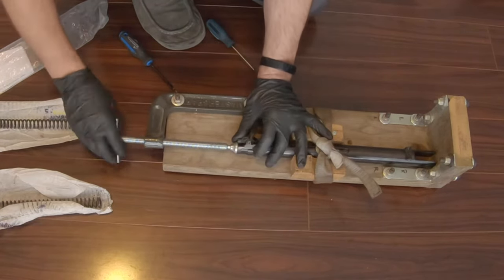And that cocking arm goes into that hole. You just got to get it kind of started in there. Oh, that's another thing too. You can see here, the piston is not totally centered in the groove. So where's my flat blade here? Just push her over a bit. Just like that. That allows this to pop inside there.